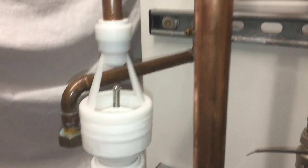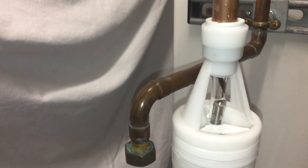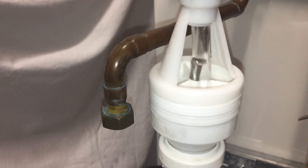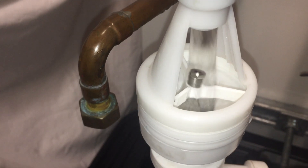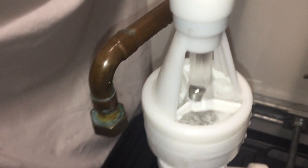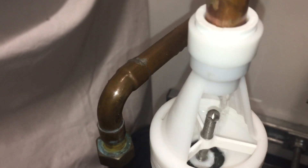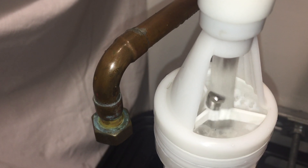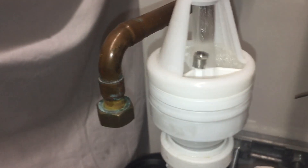Let's fire that up — the control valve is already open, so we'll then just operate the pressure relief valve. The flow is slightly more restricted. Let's go at maximum and have a look at the flow meter: 23 litres a minute. So that's the flow rate on a 32mm pipe.